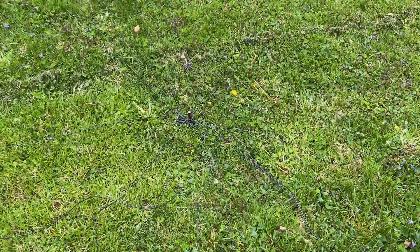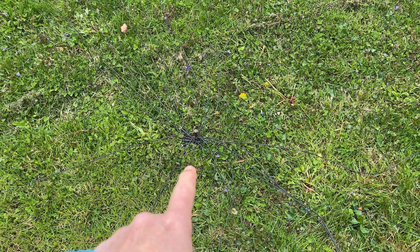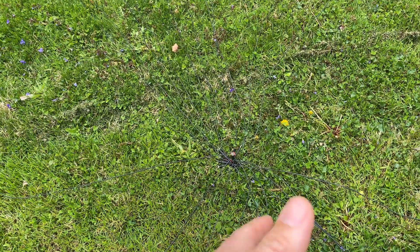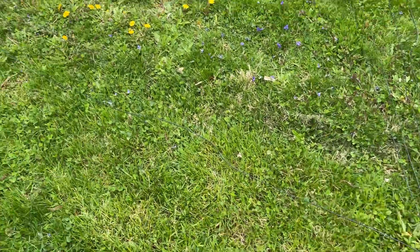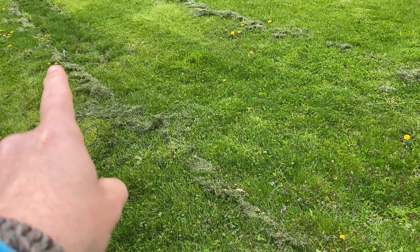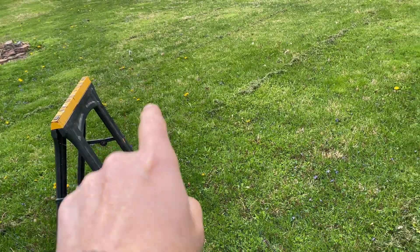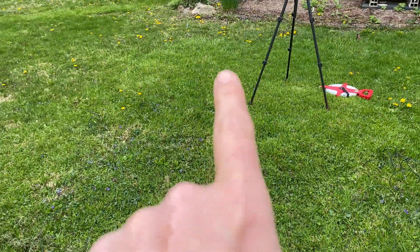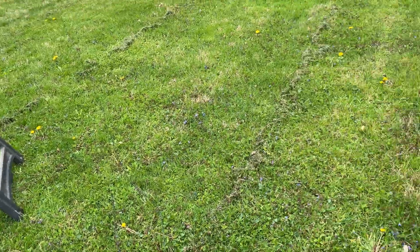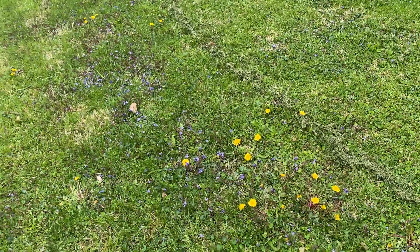The outside is ready for the antenna. I have a stake to keep the ground radials centered — that will be the expected center of the antenna mast. Off to one side I have a guying stake, about 120 degrees off I have another guying stake, same thing on the other side, and I have my two sawhorses out. Next is getting this mast out, pulling it to length, and getting it secured.